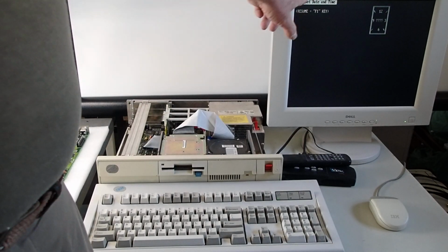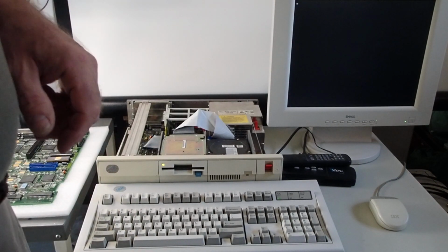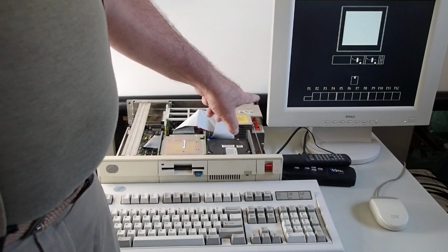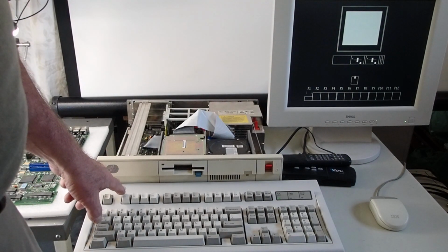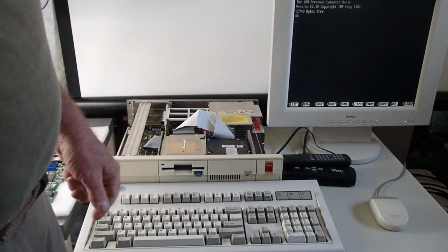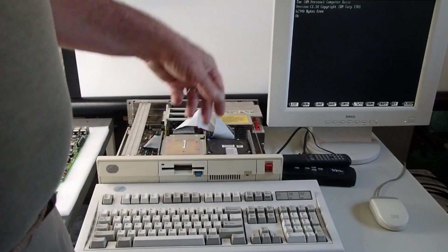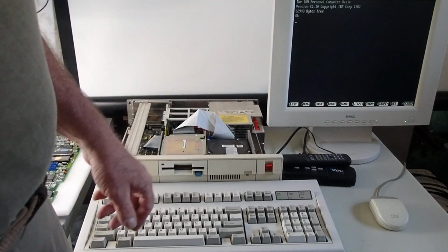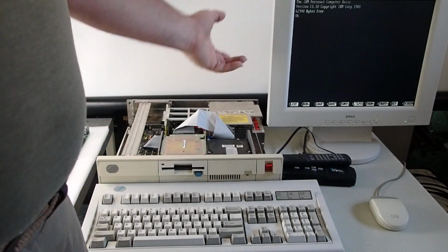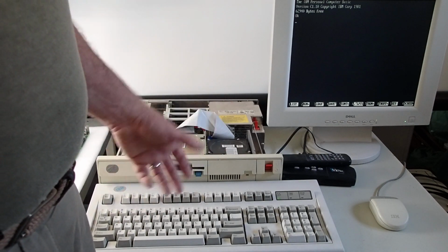It's telling us to set the date and time, and to continue to press the F1 key. So I'm going to press the F1 key just like I did before. Here's the second animation screen, showing to load the start diskette and to press the F1 key. Since there's no local media and the hard drive is disconnected, no boot diskette, it drops us into ROM BASIC, which is the default mode of these machines when they don't have any other boot media. That's a basic way to be able to run certain programs or work with the system enough as a diagnostic.